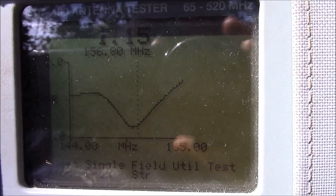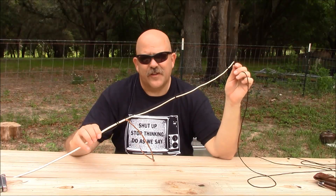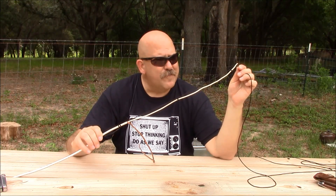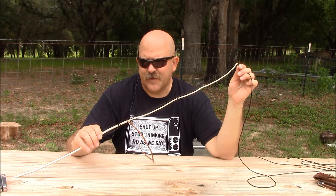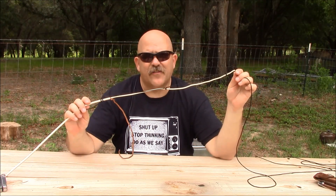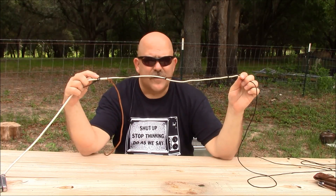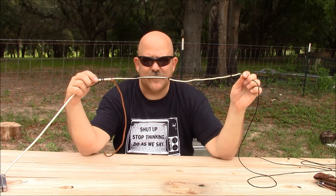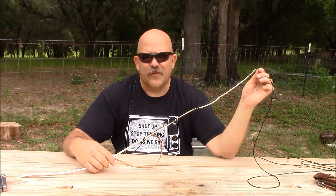The emergency coaxial antenna was a good place to start for this series because it's taught you how a quarter wavelength relates to the frequency of operation and how a half wavelength relates to a dipole antenna. We've also demonstrated how to strip coaxial cable and its components, and how to tie a clove hitch and two half hitches to support an antenna. I look forward to making more of this content for you. I hope this helps. This is Brett from Survival Comps — till next time.